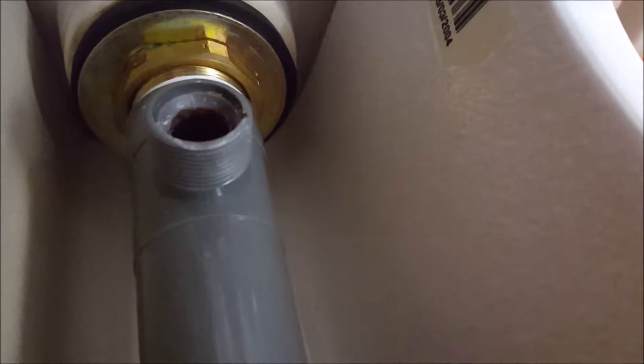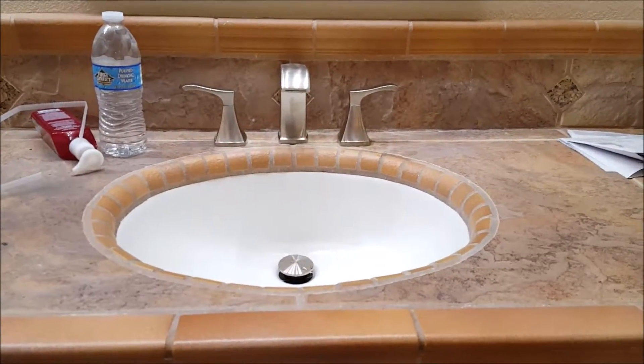The rest of it in here is probably not leaking, but if you get the rod assembly back in here and cap it off, your problem is resolved. You would just be stuck with that goldish colored drain that doesn't match the faucet. To take this whole thing off the wall becomes quite a project — requires two people, it's pretty heavy. I'd recommend if you can live with that color, go ahead and put this assembly together the way it is and that'll resolve the drainage issue.